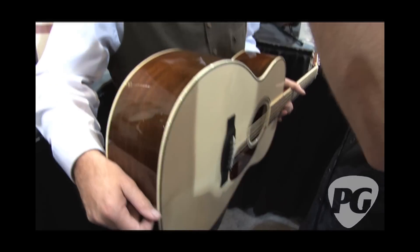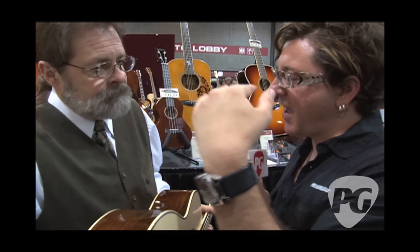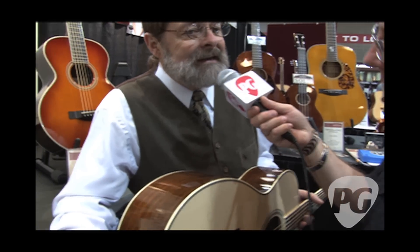When you're thinking about a guitar you're going to build and you can look at the tightness of the grain, you have an idea of how that's going to sound — a clue — but we won't truly be able to evaluate it until we handle it, listen to it, tap it, and feel the density. Our secret, if anything, is working with wood according to its densities rather than making a certain dimension a certain flexibility. You can measure two of our guitars that sound identical, but the measurements won't match. What we're doing is like what a master violin maker does — voicing and tuning an instrument for consistency. It's expensive to do that. It's much easier to assemble parts, but when you do that it's like throwing rocks at a piano. If you throw enough rocks at a piano, every once in a while you'll get a chord.